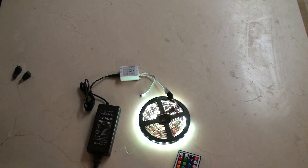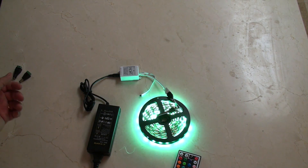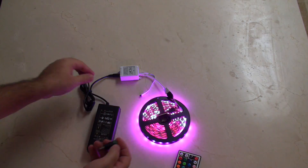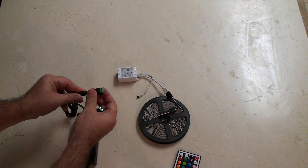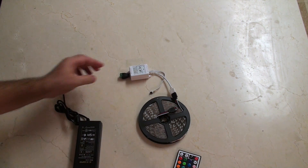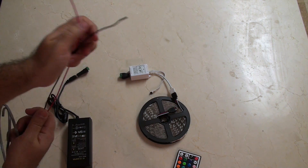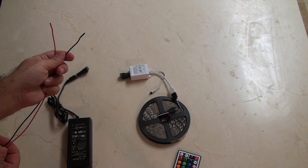I have tested this and we have really good news: this controller remembers what the last setting was. So what I'm able to do, using some male and female connectors I got on eBay, is interrupt this signal here — put that on one side with my terminals and this on the other side with my terminals. Then I'll connect those two with some wire and interrupt them with the relay.